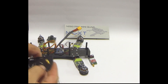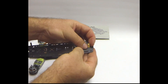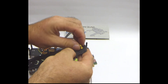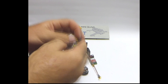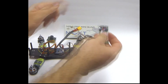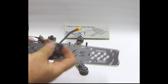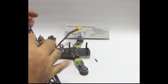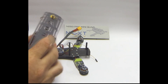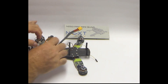To mount the VTX onto the frame, I use a pigtail between the VTX and the aerial. The reason is that if there are any bangs or hits on the back of the frame, you tend to snap the connector off the VTX without a pigtail. This way, if there's any damage, the worst you could do is break the pigtail itself without damaging the VTX. VTX is expensive, so best to protect it. I use a bit of double-sided sticky tape to hold it on top of the frame — shorter pigtails are probably a little better.